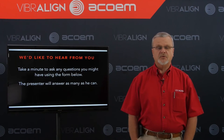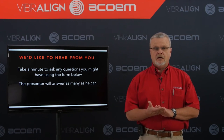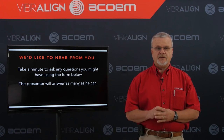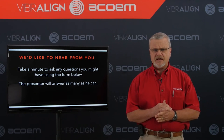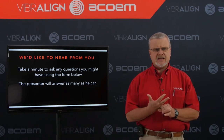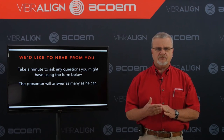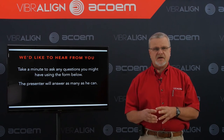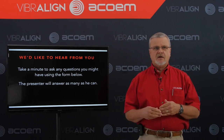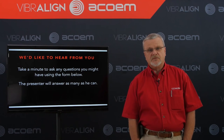Thanks for your questions — we appreciate it, and appreciate you joining us today. Let's get right into these and we'll answer as many as we can. Mark asks: what is the industry standard for acceptable misalignment? Mark, there really is, at least to my knowledge, no industry standard. API has a spec, I think NASA has a spec, and I'm sure the military has some specs, but misalignment doesn't have a universal industry standard. It depends on a lot of things: type of couplings, speeds, shaft lengths, hard start versus soft start, and specific gravities of fluids pumped.